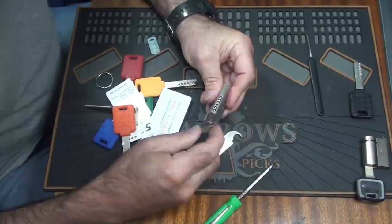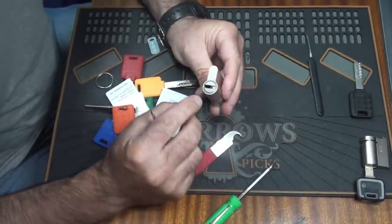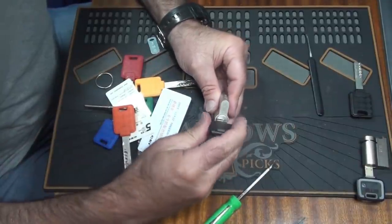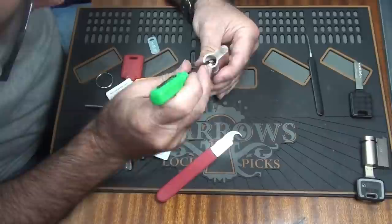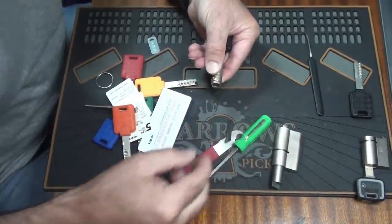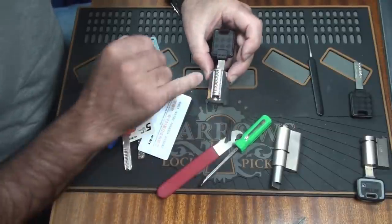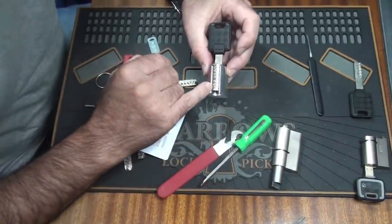Let's get the key in. Key rotates. With a dimple lock, the safest way to get the core out when you don't know what's inside is to rotate it 90 degrees so the edge of the key is up against the pins. So we're going to ram that in, turn it 90 degrees, and we're in business. Let's put the core in a holder and count pins — one, two, three, four, five, six.